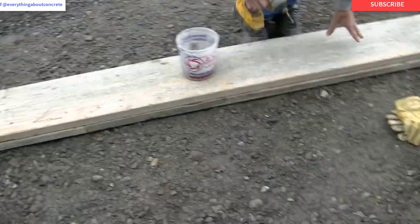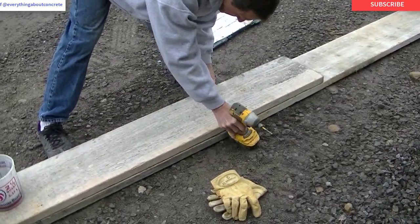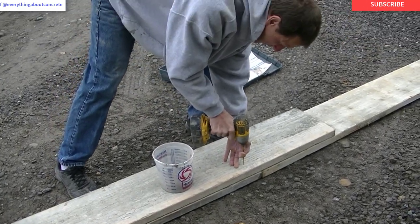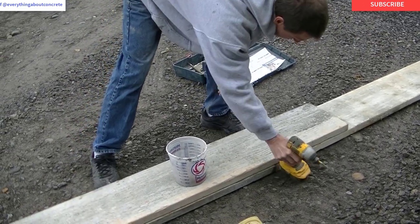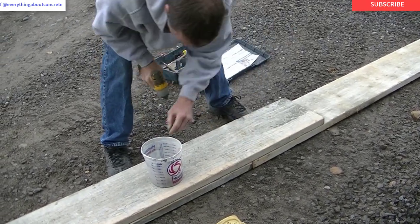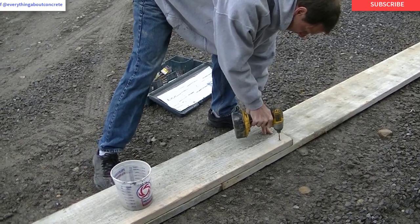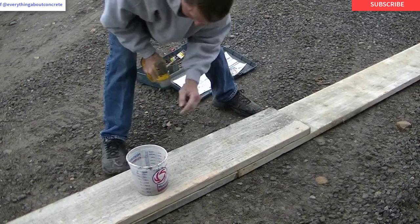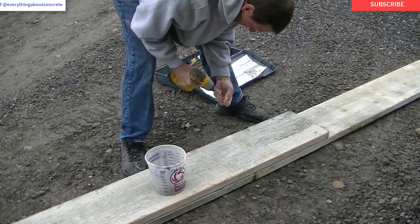I'm getting this one big long form put together — it's about 36 feet long. This is a three-bay garage we're pouring today; the drops were pretty deep, that's why I'm using 2x12s. We like to set our forms right to grade when we pour garage floors. Those are two-and-a-half inch deck screws I'm using, and the drill driver makes it really easy to install them.